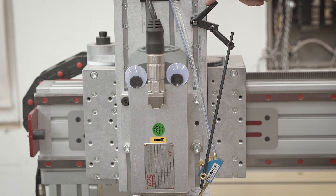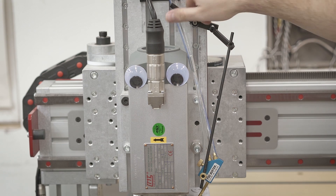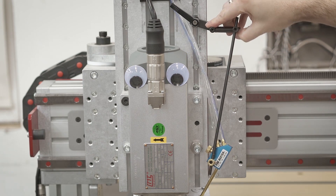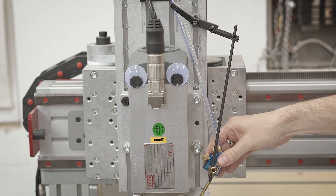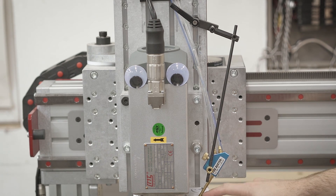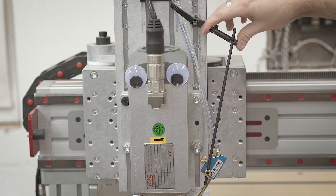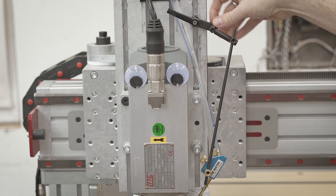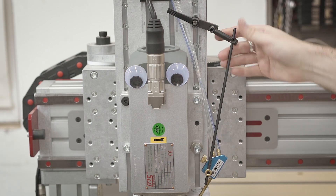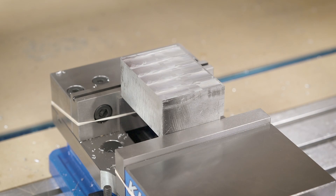For clamping the fog buster head on the mill, I'm using one of these open channel clamps — I think they're called handle wrenches — into a T-slot nut, which holds the whole thing. There is some adjustability so I can move and position it; I might need to add a grommet to prevent rattling, but this is just phase one testing. There's plenty of room for adjustment — I can just loosen it, slide up and down, and get it right where I need it.